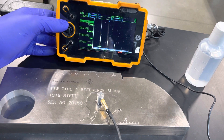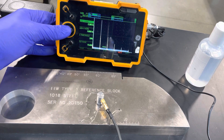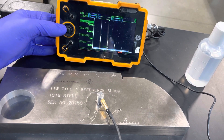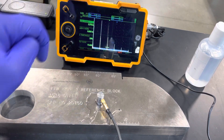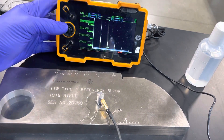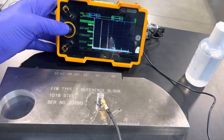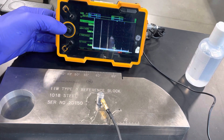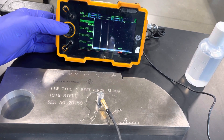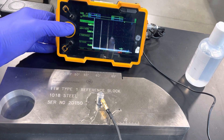The second and third reflections are 0.987 inches apart. Between the third and fourth it's also 0.987 inches. Sliding over again, we have 0.986 inches between the next pair, and 0.986 inches for the ones at the back — all well within range.